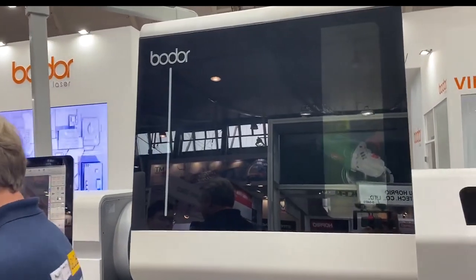Tell me about the machine please. Okay, first of all it's a tube — obviously it's a tube laser cutting machine, it's a fiber laser cutting machine. The diameter range is from 10 millimeter minimum up to 230 millimeter maximum. There's another machine that can go up to 260 millimeter, and the minimum on a different machine is 10 millimeter.